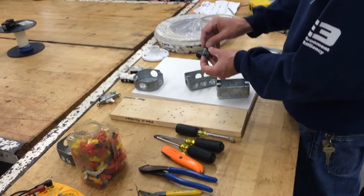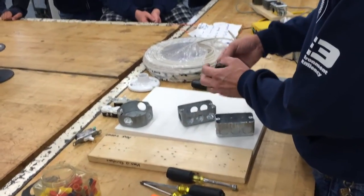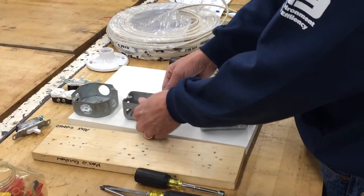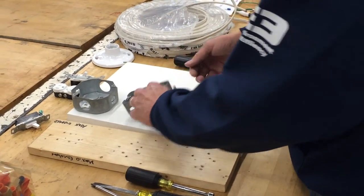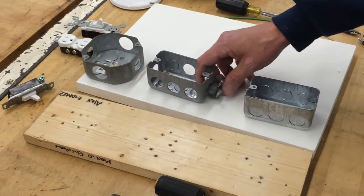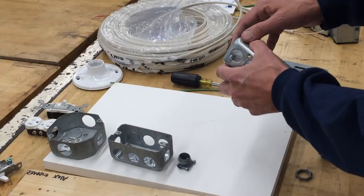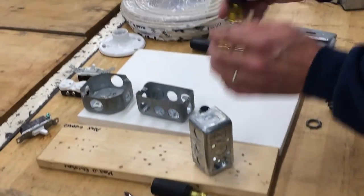So we've got to have these Romex connectors to make sure the wire is secure and snug. Don't take them completely apart — they should have two screws with a piece on top to lock in the Romex, and there's a body with a lock nut on the back. When you're putting them in, if the box already has the holes knocked out, you can start putting them in even before you put the screws down. Make sure you've got enough room between boxes. If you don't have the holes knocked out, these are called KOs — knock-outs — you've got to knock them out.